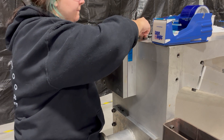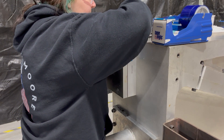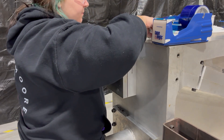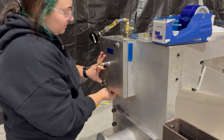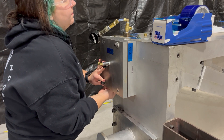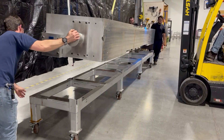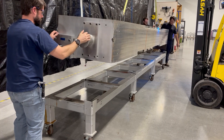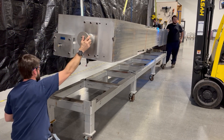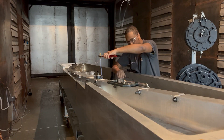The pressurization plates allow us to create a reverse autoclave effect in an oven. We are able to apply pressure to the vacuum bag during and after resin infusion to ensure we eliminate voids and fully compact the laminate. After infusion hardware is fastened to the mold and a positive vacuum leak check is performed on the system, the mold is staged onto the infusion stand and plumbed inside the oven.